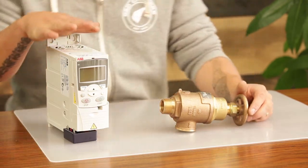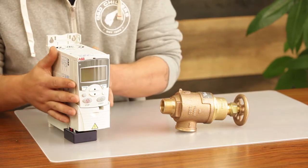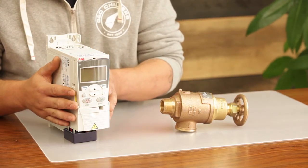The other way to regulate pressure inside the system is with a VFD here. Coupled with a transducer, this will maintain a constant PSI in your system by speeding up or slowing down the motor.